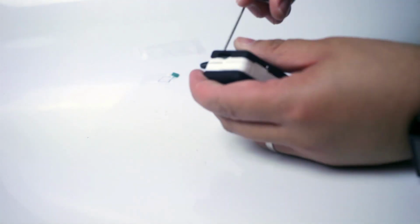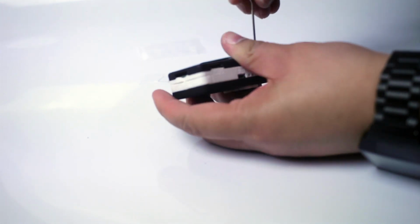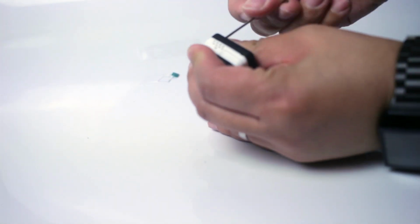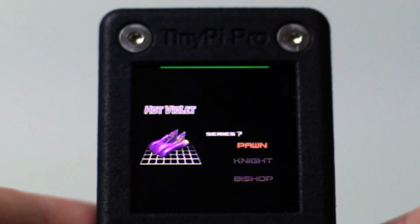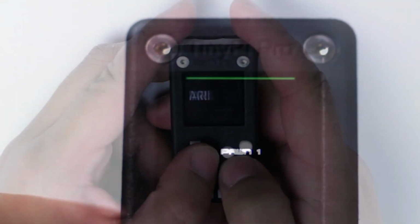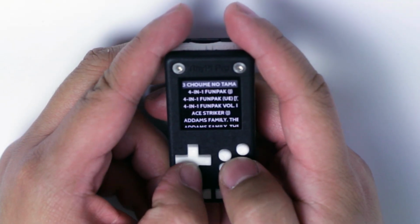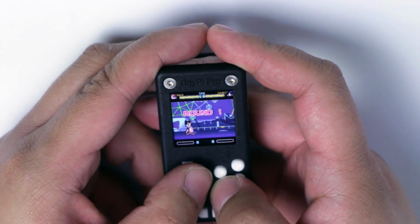Please be careful tightening the screws at the end of the build. I found that when putting a bit more pressure, it made the LCD screen discolour. So I'd recommend tightening it to a point that it's secured but not so tight that it squashes the screen to the case. The screen on the device is actually pretty sharp, and you can clearly see the tiny details such as small text, measuring at 1.3 inches and a 240 by 240 resolution. It's pretty impressive.